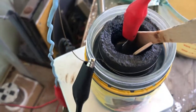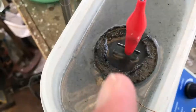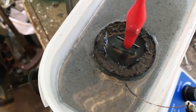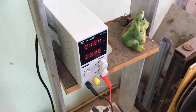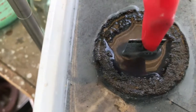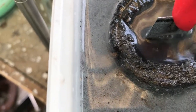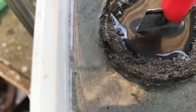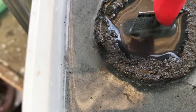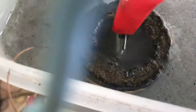And that's still plating along pretty well. A little strip of zinc is nearly gone. Now consuming 2 amps. And if you look around the outside, you watch those bubbles that go in towards the center there. See them? So I reckon the zinc's actually going through the carbon. It's extremely porous, which we want.